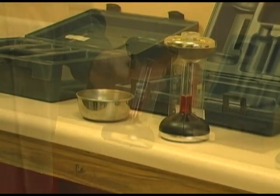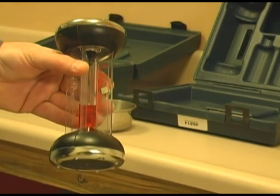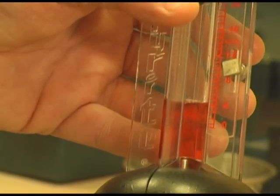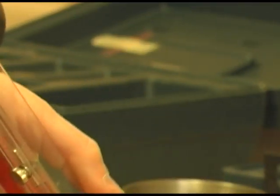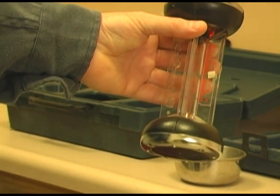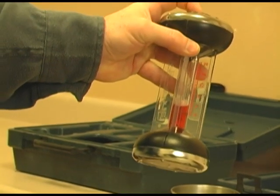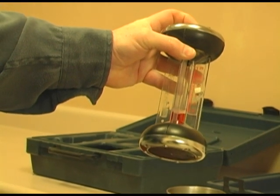There we go. Your exhaled breath is approximately 4% CO2 — as you can see we are about 4%. General practice when I make a measurement is to take and rotate this twice, not just once. So for each sample I am going to rotate it 180 degrees as a safety precaution. Never invert this with the plunger pushed, because the Fyrite will leak all over the floor.